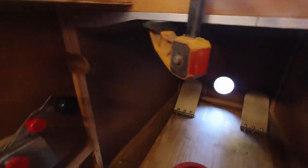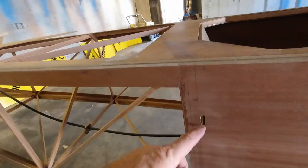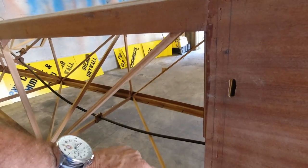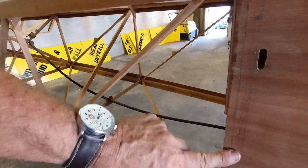All right, so here's where we're at. I've got the bracket that I shaped, just clamped in place under here. Parker has the starting location of the places here. We have our marks. This is where the bottom of the wing should line up with. This is where the front spar bottom of the wing will line up with. Distance X. This is X in the Z direction plus 1 inch. So right there.